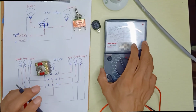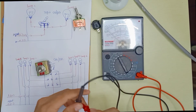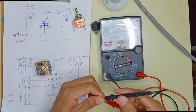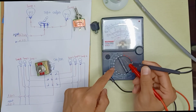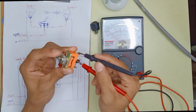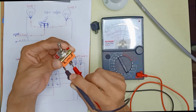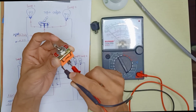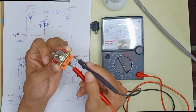If you want to make sure the switch works, you can simply set your multimeter to continuity or buzzer mode. My battery is low so there's no sound, but you can still see the connectivity reading. The middle pin is common — place one probe there and touch the other side. This side is off, but if you toggle the switch, that side turns on. Toggle to the other side and that side turns off while the opposite turns on.